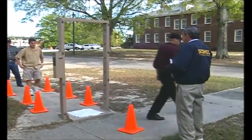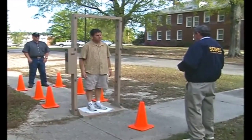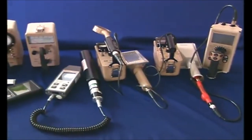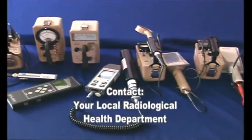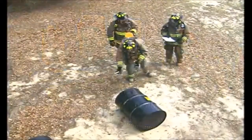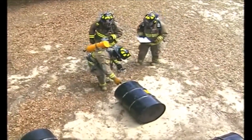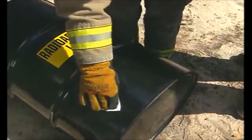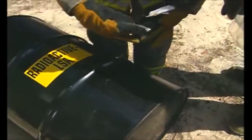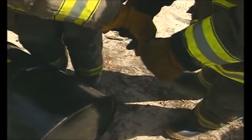If an incident involves material that would emit neutrons, very specialized instruments are required. If you're interested in further information on instrument design or selection criteria, contact your state or local radiation authority for more information. In areas where the radiation levels are elevated or if you suspect breached packages, swipes or smears may be taken, removed to an area where the surrounding radiation levels are near normal background, and measured to detect any removable contamination that may be present.